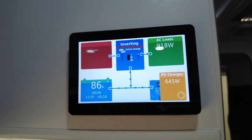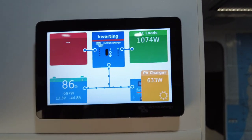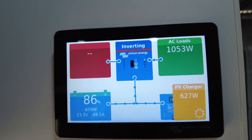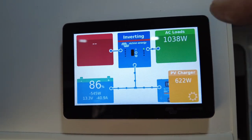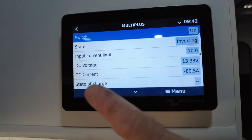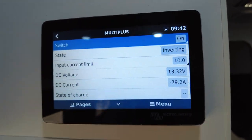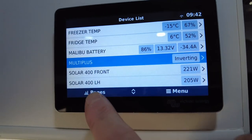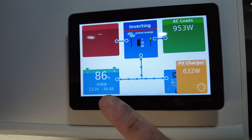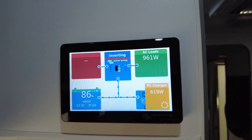It's actually not bad — I thought it would be a lot louder, the clunk-in. We had 40 amps coming in from the solar. Because of this AC load, let's see what it's pulling. We go into the Multi Plus right here — you can see the AC loads alone are pulling nearly 80 amps. Go back to pages — that's why we're seeing that number. That 40 to 45 amps we saw before is now completely offset. The little blue dots have changed direction. That's about the 950 to 1,000 watt mark running.